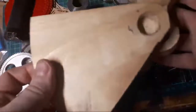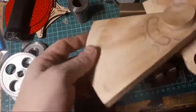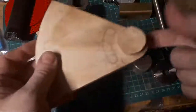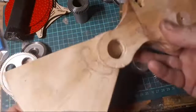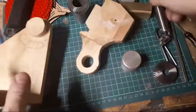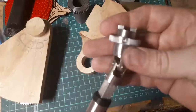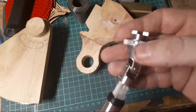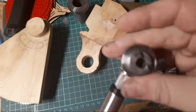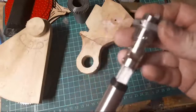I've given this a miss today because I'm a bit lost with it, but this is probably going to be just 10mm sheet, probably even aluminium, with a bush pressed in it, and another bush here. I don't know if you can see that, the spring detent goes in there, and that locks in two places on the compound.